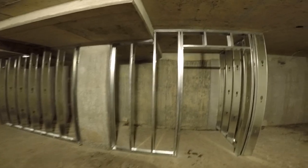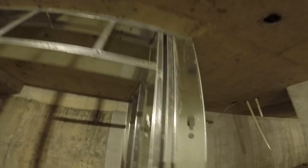On a six inch wall with five eighths drywall, come back six and three quarter inches from the end, cut the track so it can run in. It's all nice and tight. You can kind of see how it's forming now — the track, with all the different heights and stuff, it's a little crazy. Along the bottom is good though.